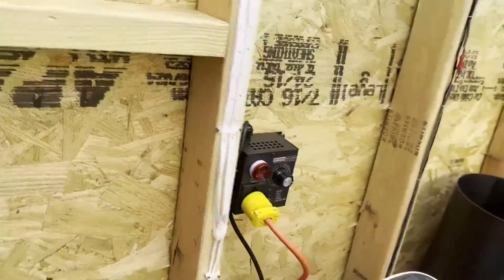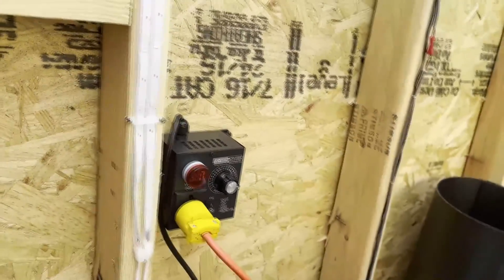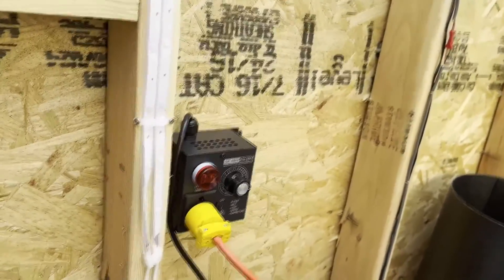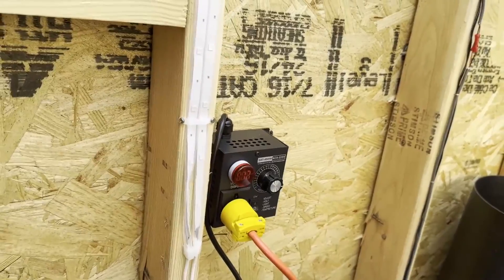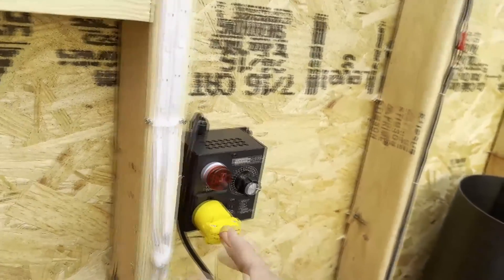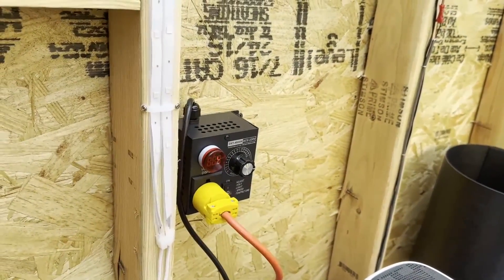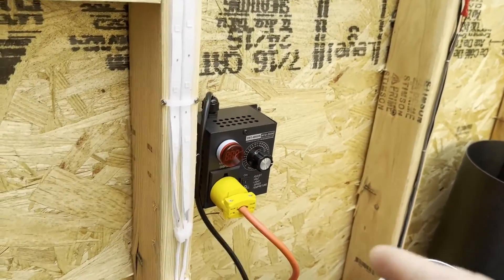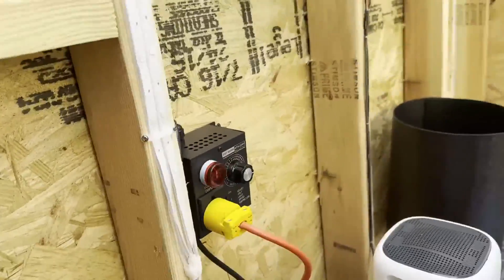The roof motor has a soft start, but it still jolts a little sometimes. Astro Bloke put out a tip about using a motor speed controller meant for fans and tools. I already had one, so I plugged it in — it drops about 10 volts, so from 120V down to about 110V — and that gives a smoother soft start. It works out pretty good.